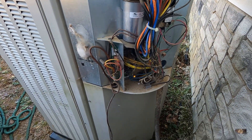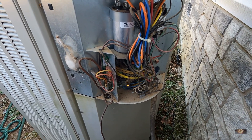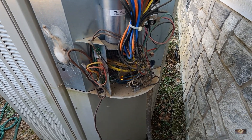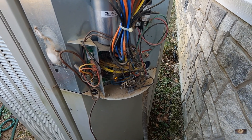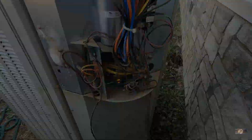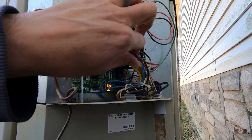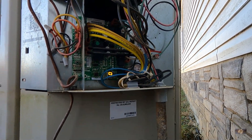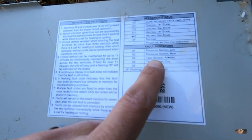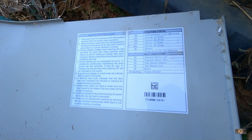Before I came out here, I looked at the indoor unit. It is an Intertherm — it was in her laundry room. The filter situation there is not real good. The coil inside is a micro-channel coil and it looks like it's got some hair on it. I went ahead and just cleared out some of the debris here with my condenser whisk. Looking down here, it looks like we have a coil temp sensor fault, code 04. So I need to see what's going on with that.